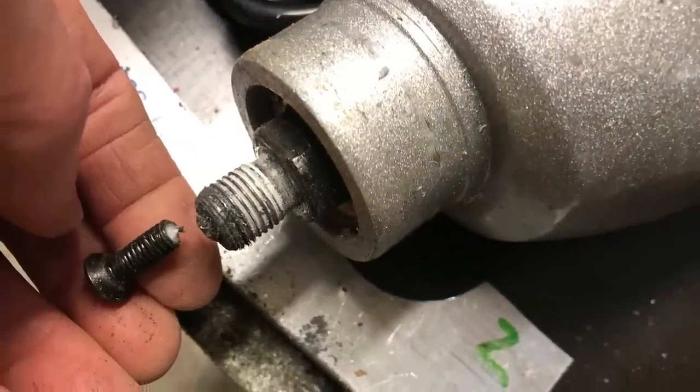and the wheels turning, like, what is it, anti-clockwise? They are also secured with a screw for taking up the forces when the machine is going backwards, but when we're hitting the throttle full on and we're just spinning around and having fun, we managed to actually rip that screw in two pieces, and the wheel started to unthread from the motor shaft. So the wheel was pushed out against the surface of the structure, so it locked.